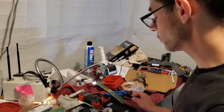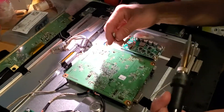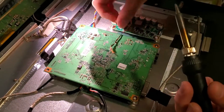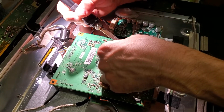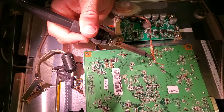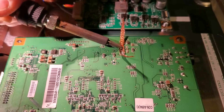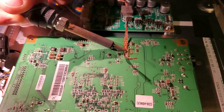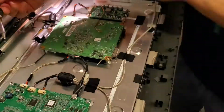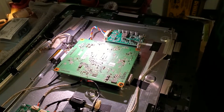Once you get that off, it goes right in the trash. I put the hot air gun down so I don't damage the new one, and then do the rest with a soldering iron — right now at 437. I take a little piece of wick, dab it with a tiny speck of solder to get it flowing, and then go right over the pins with the wick and suck up any solder that was there. That gives you a fresh, clean surface.